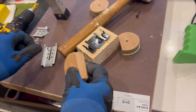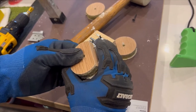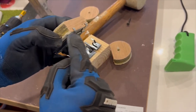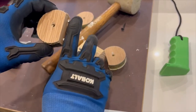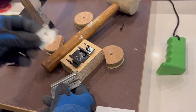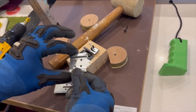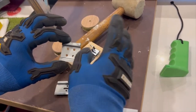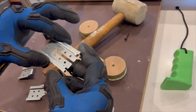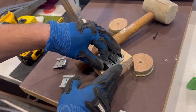For the end clips and starter clips, you mount them and then you have to penetrate the side of the material. You will end up with these little clips showing at the end, so you will want to do some sort of trim to hide that. These are what they call the end clips, which is why they ask you to leave an inch at the end if you're mounting across a whole ceiling. If you're not going all the way to the corner, you could put one screw through the middle, put a little glue on the back, get the board on, and pound it into place.